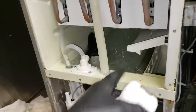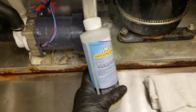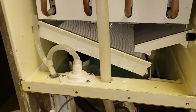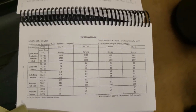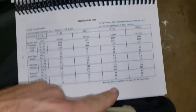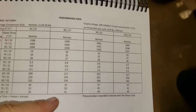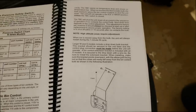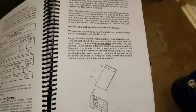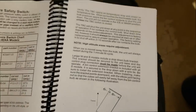Now we can do a calculation based on how much water this sump holds. After I'm done, I'm going to use a sanitizer — follow the instructions to sanitize all surfaces your hands touched. I started a timer and waited for the 5-minute mark. I found pressures of 47 and 205. Hoshizaki looks at the 5-minute mark for pressures. We're running right about 80 degrees, so pressures aren't too bad. Also, this unit should have an extension bracket and it doesn't — both machines need it. I'm finding a bunch of problems.